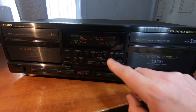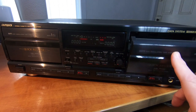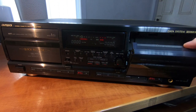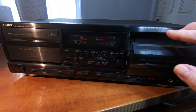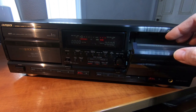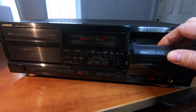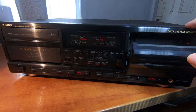There's a nice display on this. Soft open doors - they're not motorized, but that's OK. There is a stabilizing panel in here as well. A lot of the higher-end decks have this stabilizer inside. It's basically a sprung-loaded panel which keeps the tape secure in the player - it puts pressure on the cassette shell and keeps it from moving around.